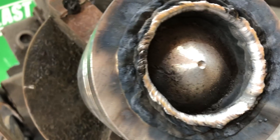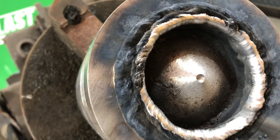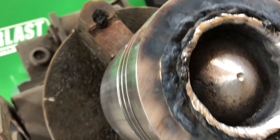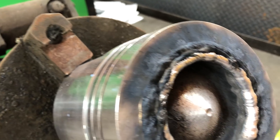If anyone has ever tried to do build-up or gap-closing with a spool gun, then you know how hard this is with wire. Now of course there will be people out there saying they can TIG this all — yeah, you can TIG this at like an hour, hour and a half a piston. Or you can wire weld them in about five to ten minutes.